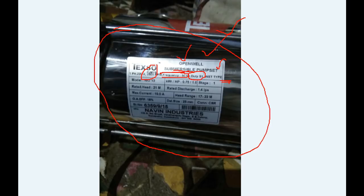From the flow data, there is no water guard. If you don't have water in 30 seconds, you will have a bearing failure. So we are going to talk about this practically.